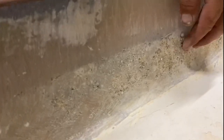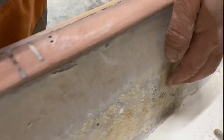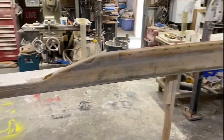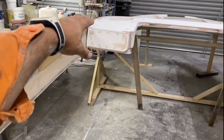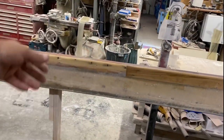I just wanted to show you guys this. I tried to grind down to the good stuff but I'm worried there's going to be nothing left — it's very thin in this area. It's an entire driver's side, the right-hand side of the top of the deck. It's pretty annoying — everything's all rounded. So I'm thinking about putting a couple of layers of glass on it and trying to start fading it into the dash. Wait for it to cure and then I'll straighten it up better with some bog, and then do another two layers of glass over it.